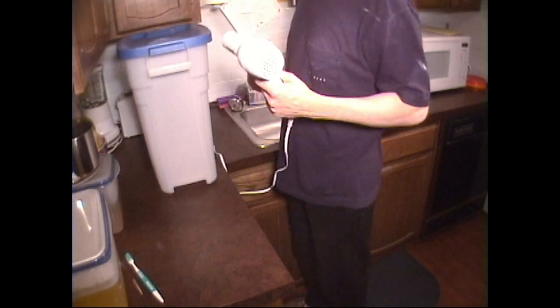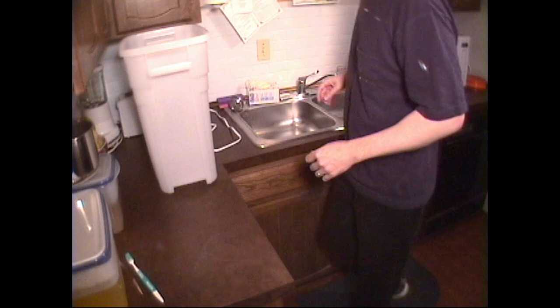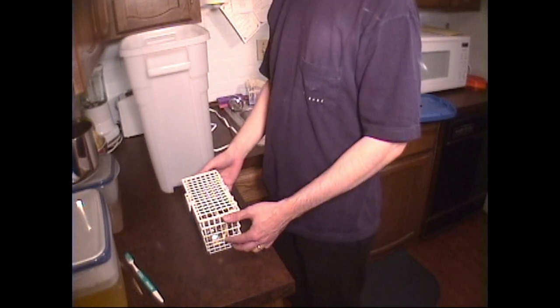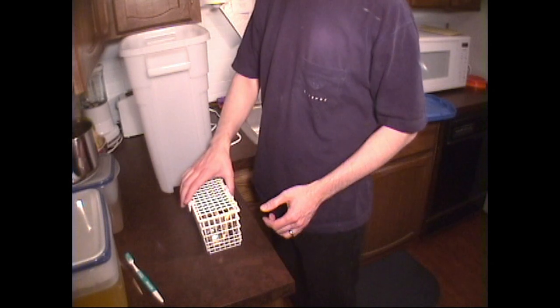All right, I think our movement is dry now. So I'm going to remove the hair dryer, take the lid off, and pull out the movement. Most likely the movement, the brass itself, is going to be very hot to the touch, so you want to let it cool for a while before you actually touch it.